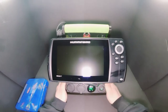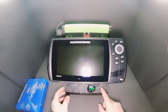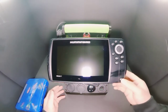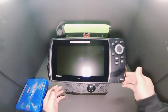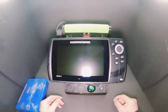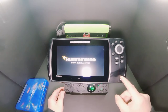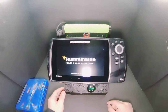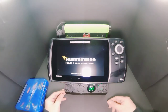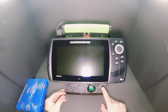One thing I did was rewire the power switch so it's connected to my Humminbird Helix 7. Before, the switch only powered my accessories but not the Helix 7. Now if I turn the switch off and press the Helix 7 power button, it won't turn on. Once I hit the power switch and press the power button on the Helix 7, it powers up. I recommend turning the Helix 7 on and off using its own power button rather than just flipping the main switch, as it might cause a short. There is an inline fuse in the back that came with the shuttle.